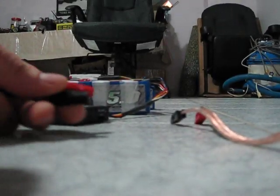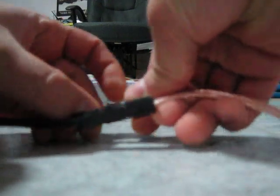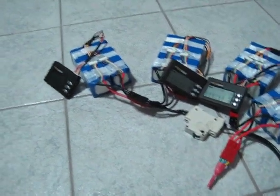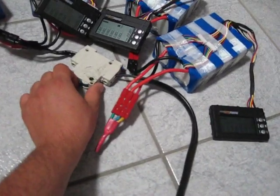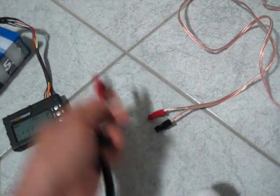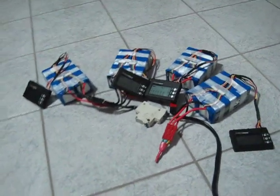So basically what you do: hook it up, make sure the breaker's off, hook that on, plug that in, hit the breaker, and we're in business — that's how we charge. When you're ready to go, shut it off, unplug it, plug your controller right into that. Run the battery until it's dead, plug her back in, charge it up, and there you go — you're in business. Thanks.